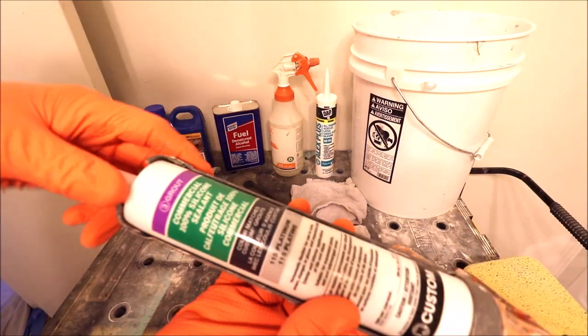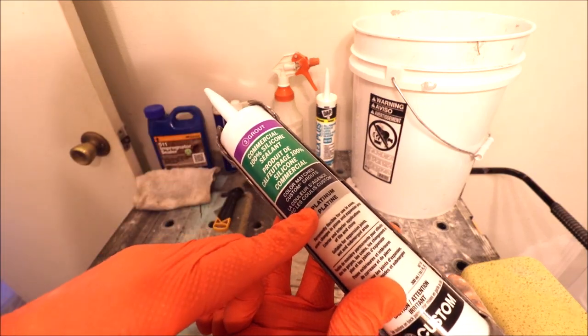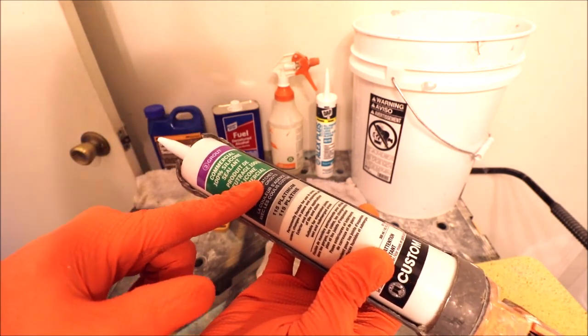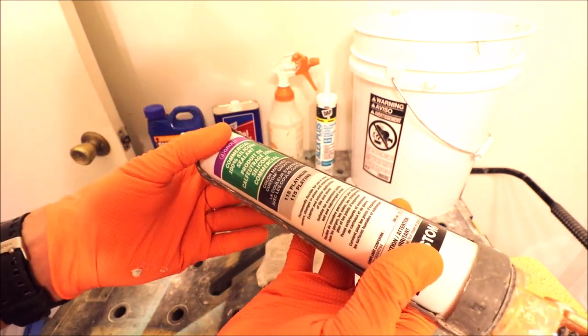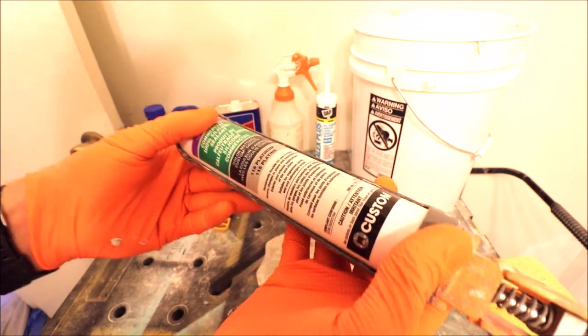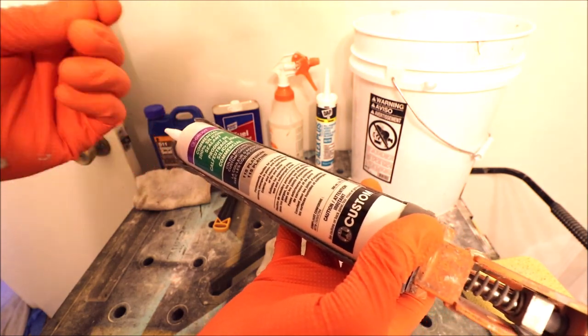So next we use 100% silicone grout color match platinum. This is where planes meet. Tile meets the ceiling, tile meets the tub flange, and where both walls meet on the left and right side. Silicone allows for expansion and contraction so that your grout doesn't crack over time.